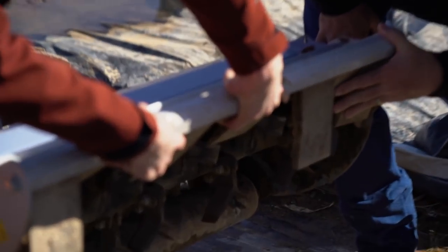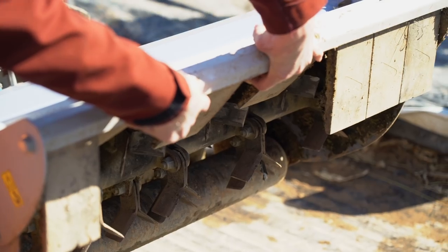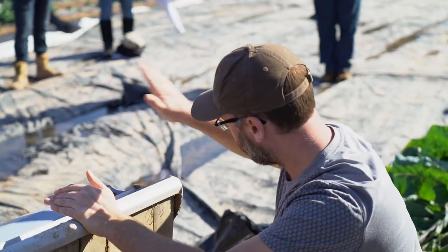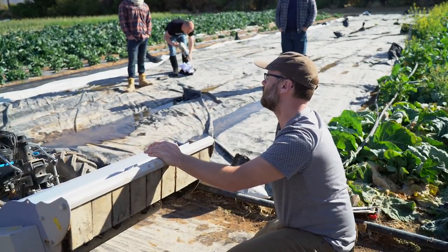It's different from a mower, which has a horizontal spinning blade on a vertical axis. This has vertical spinning blades that flail on a horizontal axis — so not only does it mow, it mulches. It's not meant for precision mowing; it's meant to shred. The front-end piece pushes things down, so you can literally walk through brush that's six to eight feet tall and shred it into mulch, whereas a normal mower would never work.